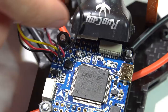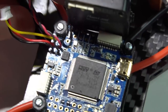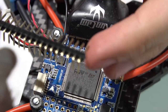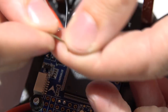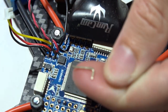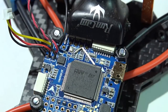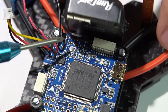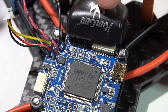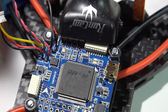You actually have more than just that option. To jump these pins, I took a 90-degree pin header, removed the plastic, which gave me a bare pin. I soldered that into the VCC hole — choosing full battery voltage — then trimmed the pin a little shorter and soldered the other side of the pin to the middle RAM pin.